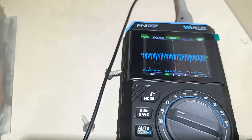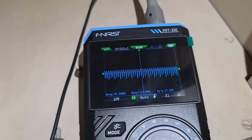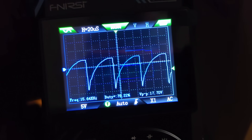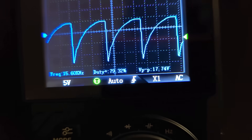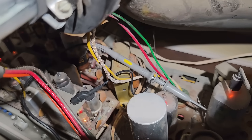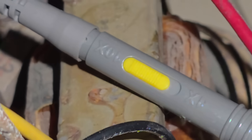How do I change the time base on this? This should be looking at the grid. I just hit the auto button here. That looks pretty good — 15.6 kilohertz, that's about right. The signal looks good. 17.78 volts, but I'm on the 10-to-1 probe here and I have the probe set to 10. So that looks good, because we were supposed to have 180 volts.